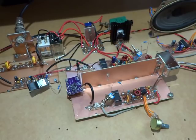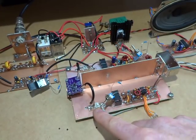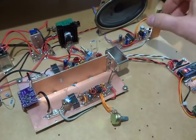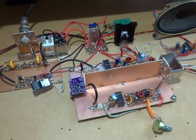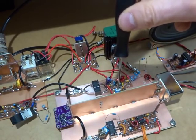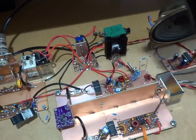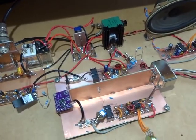The AF amplifier is certainly deadly quiet. Turning off the IF amplifier output as the input to the product detector mixer and introducing 50 ohms to the RF port — with the volume cranked right up, it's quiet. So the audio frequency amplifier is introducing essentially nothing. Another interesting observation: the trim pot on the first IF amp provides varying current through the diode, and interestingly you need very little gain for the radio to be quite sensitive. We've got plenty of headroom to play with in that first IF amp.